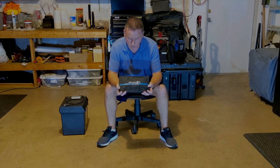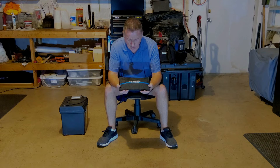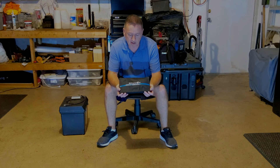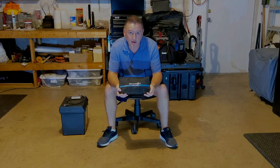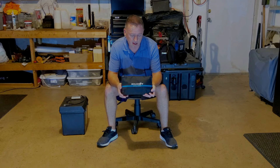This particular one is 20 watts — that's what it's rated at — but generally you get about 15 out of it. They always rate panels higher because those are under ideal lab conditions. As many of you probably know, you never get the full rated capacity out of a photovoltaic panel. It's good enough to give me power to run a lot of items that I feel necessary when camping or hiking.